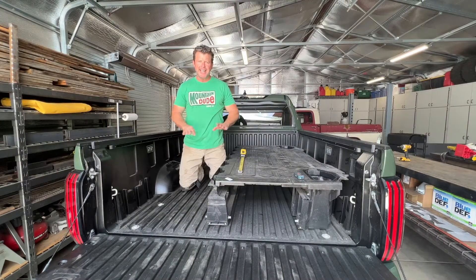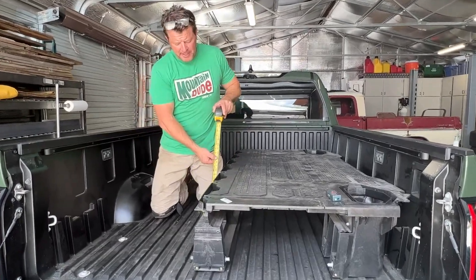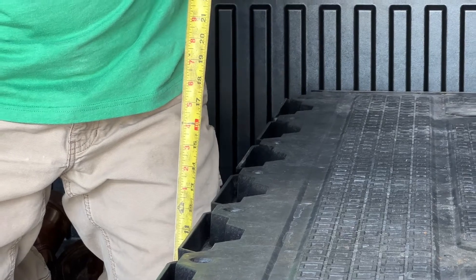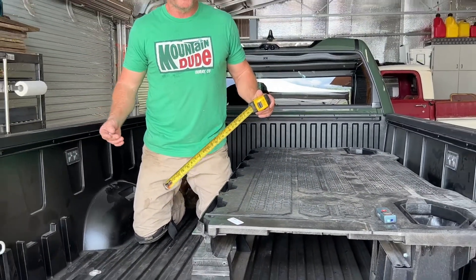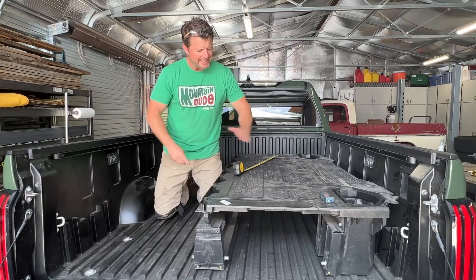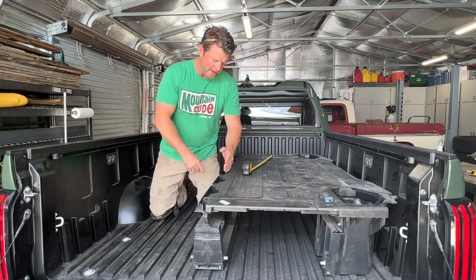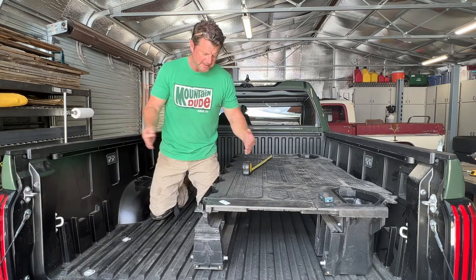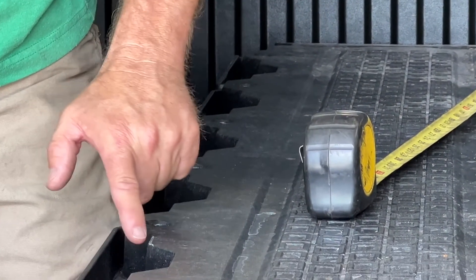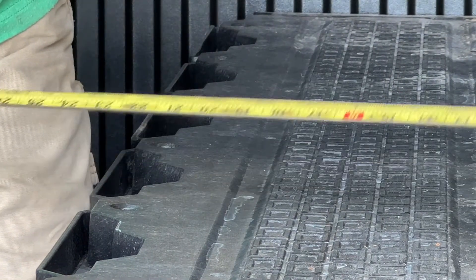So we measure 63 and 9/16 at the most narrow point at the level of the deck system, which measures somewhere between 12 and 12 and a half inches tall. That's where you want to measure your bed size because beds may have a slope. Now we need to find how much to cut so both units fit perfectly, so let's find the midpoint of the deck system — this chalk mark right here is the midpoint.